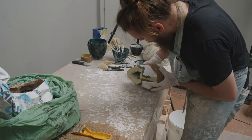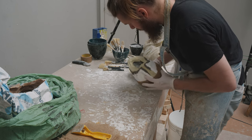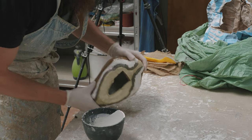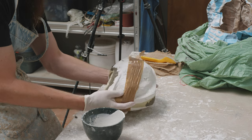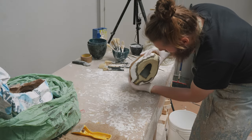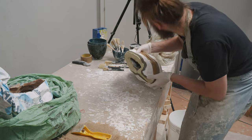The castings should come out hollow unless you do too many layers, and therefore, if you do it right, they should be pretty light. Rotocasting doesn't use any burlap, especially inside this type of mold, so it's not as strong as a cast reinforced with burlap, but it's very likely going to be more than strong enough — especially for something this small or anything about the size of a portrait.